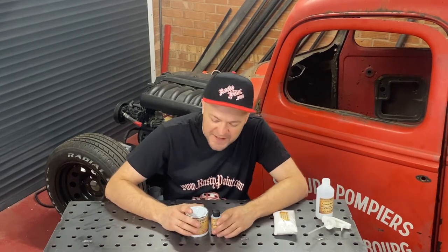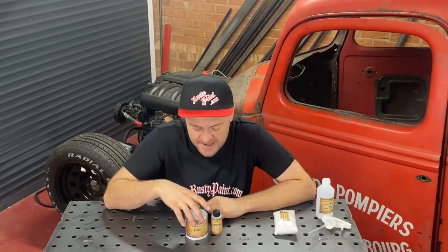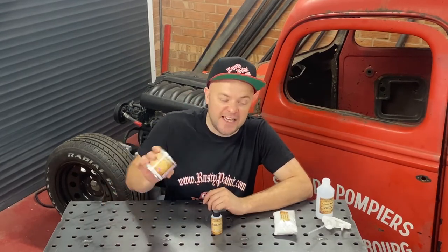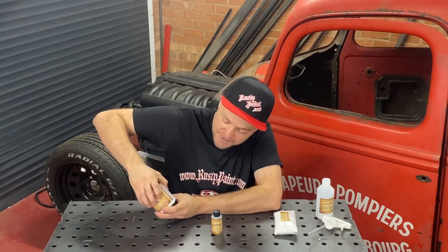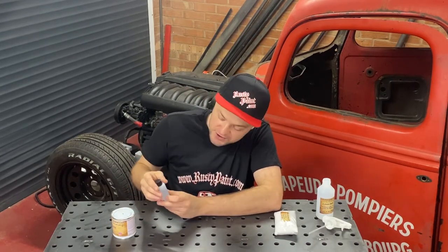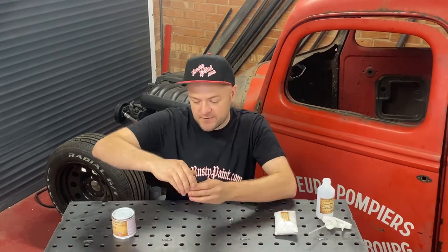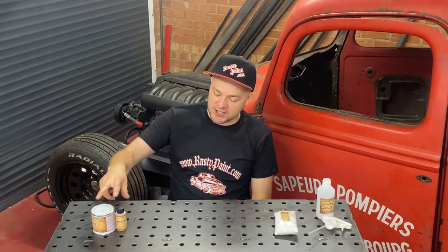If you want to paint something smaller and don't need the full tin, we've worked that out for you too. If you want to use half the tin, roughly tip out half by eye into an old container, then use half of what's in the hardener bottle — you can draw a line on the bottle at roughly halfway. Reseal both and store them separately; because they're kept apart they won't harden, and you can use what you need when you need it.